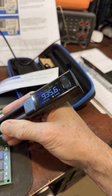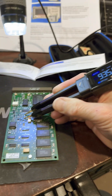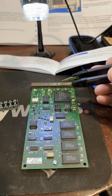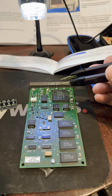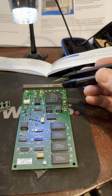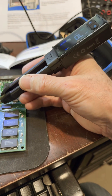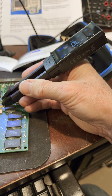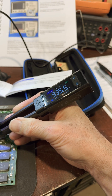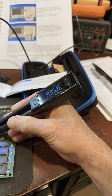935.6 ohms. Now, there's two resistors in parallel there — the original 3,160 ohms, and then you solder in parallel a 1,330 ohm resistor. And they should total 936 ohms. And again, we're getting 935.5. Certainly close enough — well within 1%. So we're good there.